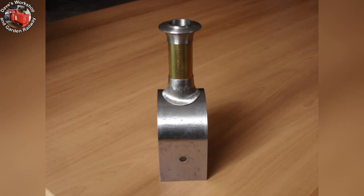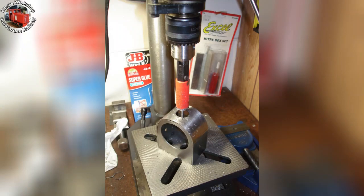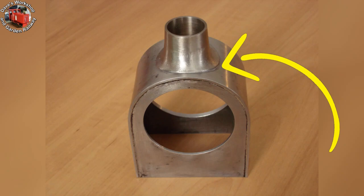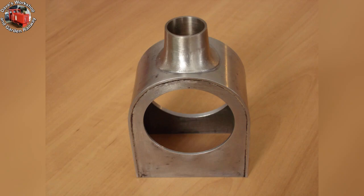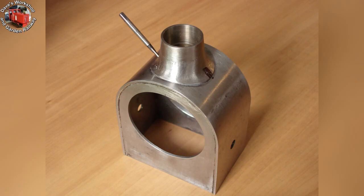Now the base needs holding down. I did some further smoothing with 120 grit abrasive paper under the running kitchen tap. Hole sawing 20mm diameter for the exhaust, using the existing small hole as a guide. The base has been soldered to the smokebox using plumber's solder — you can just see a faint outline where I drew around the base with permanent marker as a tinning guide. Both the smokebox and chimney base underside were tinned with solder. I preheated them with a gas torch before applying the solder with my 80 watt soldering iron. I use a zinc chloride liquid flux — steel solders very well. The parts were then joined and the hole heated with the gas torch to re-melt the solder. Now I could drill and tap 10BA holes for the fixing screws — it's always nerve-wracking tapping 10BA in steel. Plenty of cutting oil and much tap reversing was done for each hole. Not a single tap was lost.